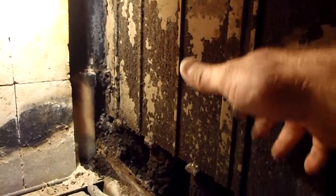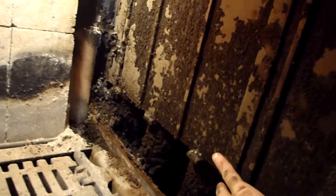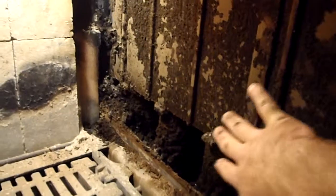And now you're starting to see a couple of features that make the stove burn really well. Now that's some pretty good creosote in there. You look down inside those pipes, that's what we want to get out. What happens is smoke goes over that firewall I just removed, hits this plate and hits the ceiling and drops down and goes underneath, excuse me, not underneath the cast iron wall, and through the pipes on the other side and up.